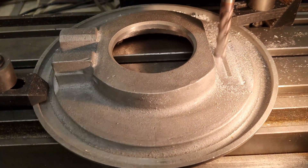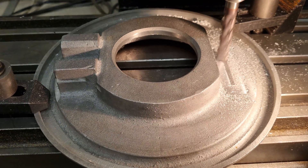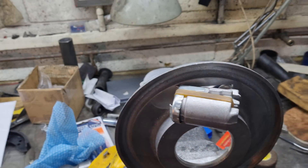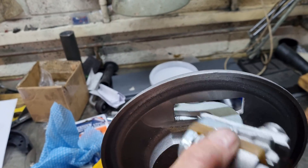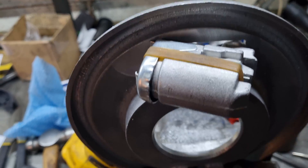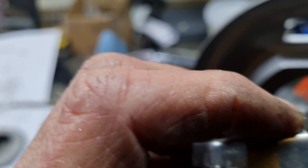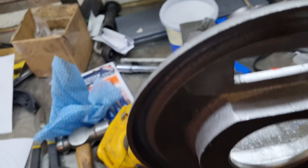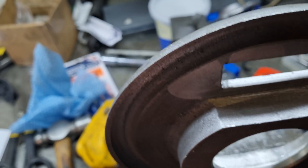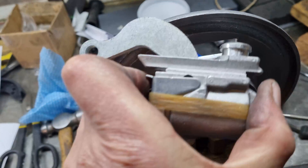This is cutting the slot for the wheel cylinder. It would appear that no matter how accurately you cut the hole, the slave cylinder will not fit in the back plate, and the reason for that is because the gap allowed is four millimetres and the back plate — the alloy casting thickness — is about six millimetres, so something has to be done at either end to allow the cylinder to engage.